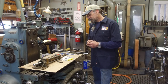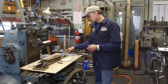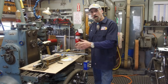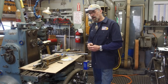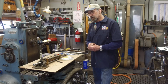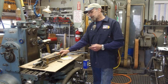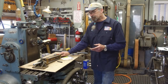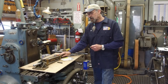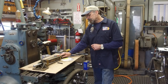That's walk the talk. All right, a handful of O-rings, a couple wipers, a new nylock, a new piece of stainless shaft, or stainless rod, in there. It's actually a precision ground rod I put in there. That's not just a piece of cold finish stainless. That's precision rod because we're talking about seals. And it is grade 316, so it stands up to the marine environment. And he got a little cleanup, mechanically clean on the outside of the cylinder there.